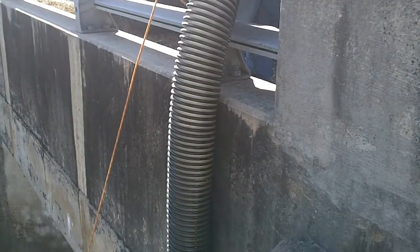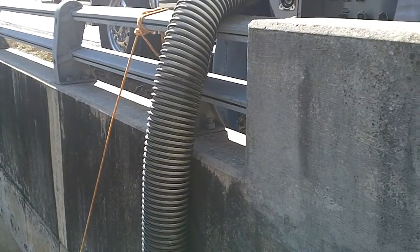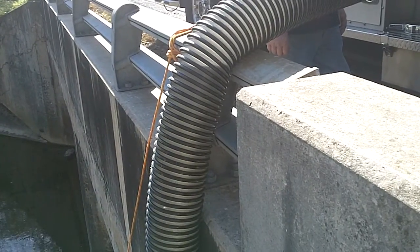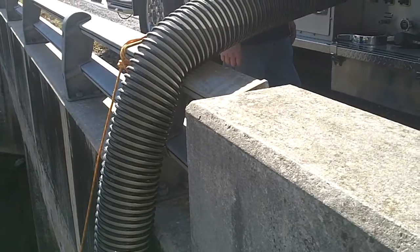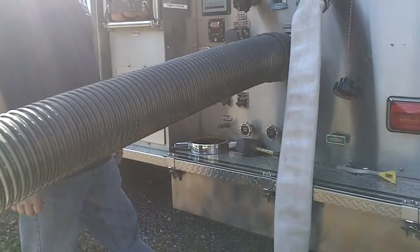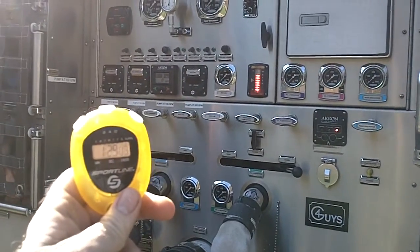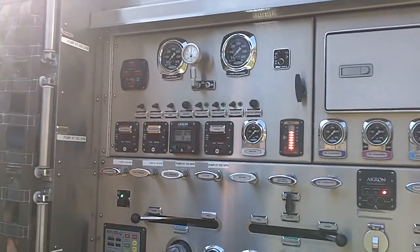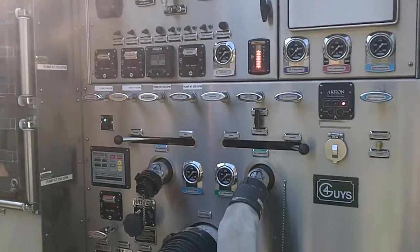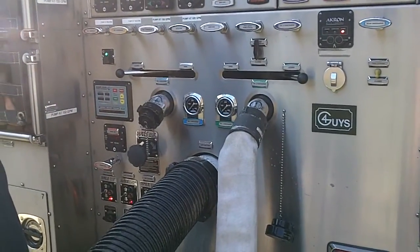Notice the driver operator is touching nothing on that pump panel. We're at 57 seconds. The air primer is still working — automatic feature. Remember, gravity is trying to pull this water back. Now it's going to start coming into the pump. We're at a minute 16. We'll start to see discharge pressure on this pump once the pump fills itself up. Minute 28. Notice our vacuum is at about 14 to 15 inches, which equates to about 16 feet of lift from the surface of the water to the eye of the impeller. Minutes 43, 44. We should start to see some changes occurring as the pump casing fills up.